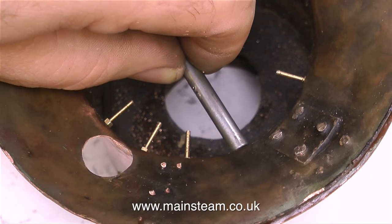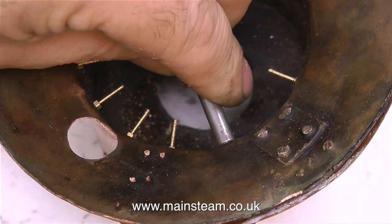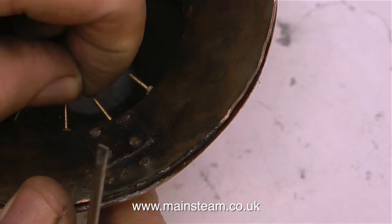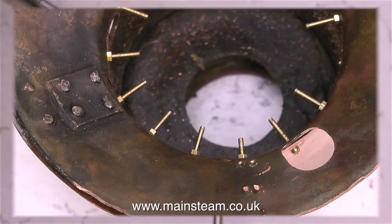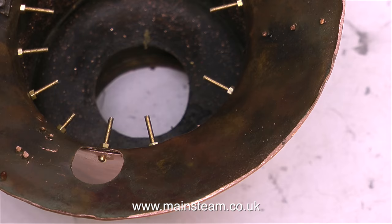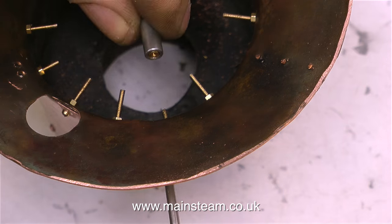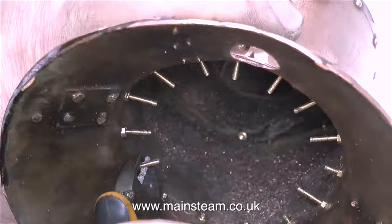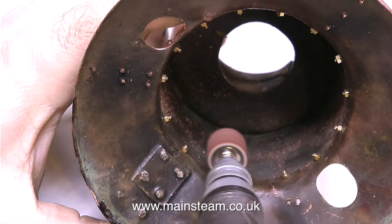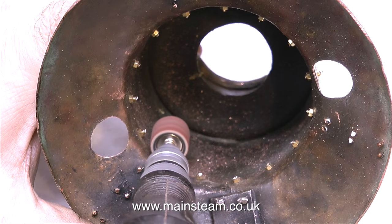I've reshaped the bottom piece, so now I can drill through, and this time I'm installing 10BA bolts. The piece you're watching at the moment is the easy part — the hard part was reshaping the flange on the bottom piece. What I had to do was profile the inside edge of the vertical tubular part to accurately fit over the flange on the base mounting that goes on the boiler. I did actually video some of this process, but most of the video ended up just being my hands or parts of me in the way, so I'm just telling you about it instead. It was very difficult. Whilst I drilled the holes, I had to put some positive pressure on the main part to make sure the holes were well down into the copper, because the original holes were very near the edge and therefore the whole thing was weak.